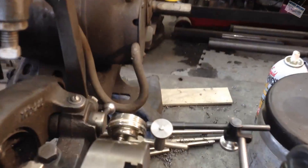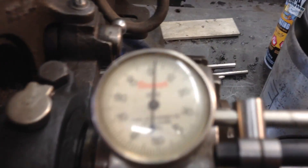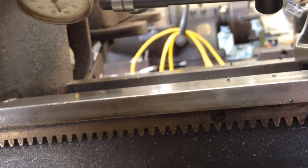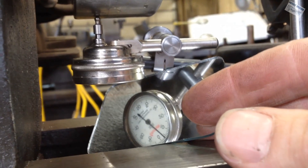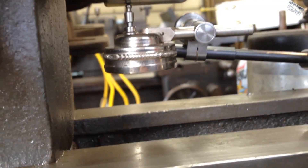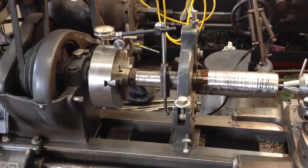Here is a little bonus footage. Back there is two thousandths. Up on top is two. On the side is two. The bottom doesn't quite agree — there is this thing called indicator sag and it's really hard to show you through the mirror here. It looks like four through the parallax, but I'm actually at three. I think that's okay because the indicator is sagging with gravity. I feel like I am spot on that way and close enough for this project, so I'm gonna leave it. Thanks for watching.